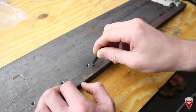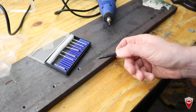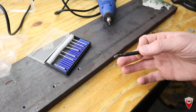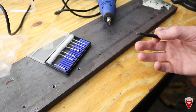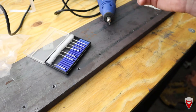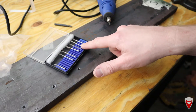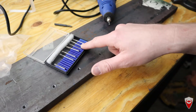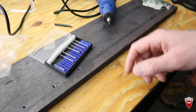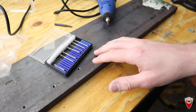We're going to have a crack at a broken tap removal today. Since this tap is made of high-speed steel, we can't use any other high-speed steel to get it out because they're the same hardness. We need something harder than high-speed steel to effectively cut it. The weapon of choice in this tap removal game is carbide burrs. Carbide is harder than high-speed steel — it's marginal on the fringes where there's some overlap, but in general carbide is significantly harder.